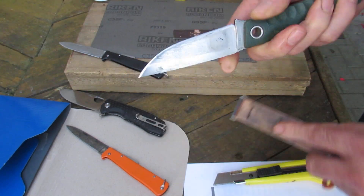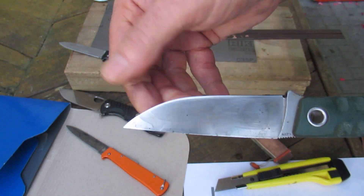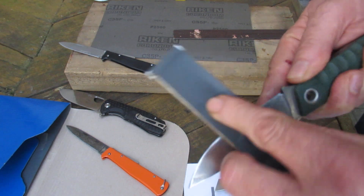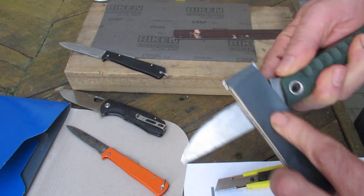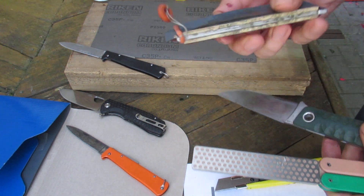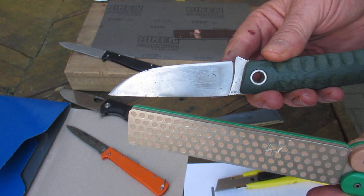It's the same if you get a small scratch in your knife and you want to keep it all pristine — how much work you have to do to sand that back out. But it's starting to polish back out. I'll just run this diamond, which is 3,000 grit, over the top of that. There's only about 500 grit more than the sandpaper, and that has brought it back to polished. So this 3,000 grit diamond and the 2,500 grit sandpaper actually leaves a more polished edge than the DMT diamond stone classed as 8,000 grit. Go figure that one.